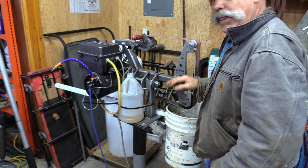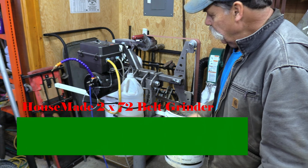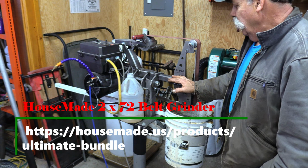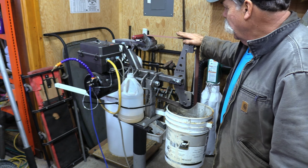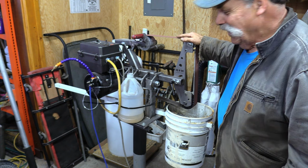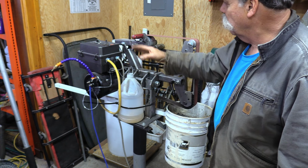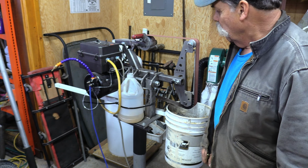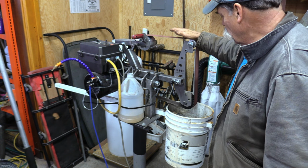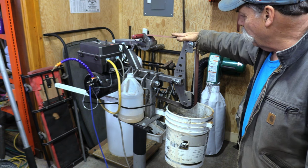So right here is one of the, let's see, Brian House, Housemaid. He has a channel, but he has a business, and one of the things he makes is a 2x72 grinder kit. So I picked up one of these and built this, and all I can say is this is awesome. This thing works fantastic. 2 horsepower, 3-phase motor on there, VFD. Now it doesn't come with a motor or VFD. You have to buy that separate. And the wheels, I bought the wheels with the kit. So yeah, it works absolutely awesome.